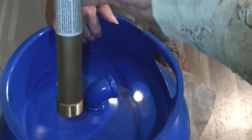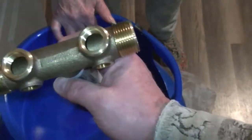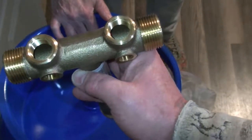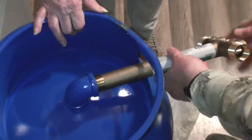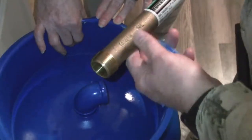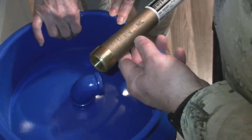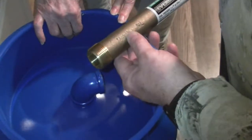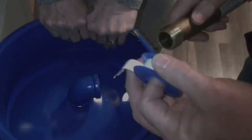This is the T that's going to fit into the bottom of the tank. It's got two 1/4-inch connections for the pressure gauge and for the switch, and two 1/2-inch connections for a drain valve and a relief valve. First, you want to do a dry test to check that it's going to fit into your tank — and it's going to fit. Next, we apply plumber's tape, thread tape, to the threads going into the connector. You apply thread tape in the direction opposite that the pipe will thread in — if it threads in counter-clockwise, we apply tape in a clockwise rotation.